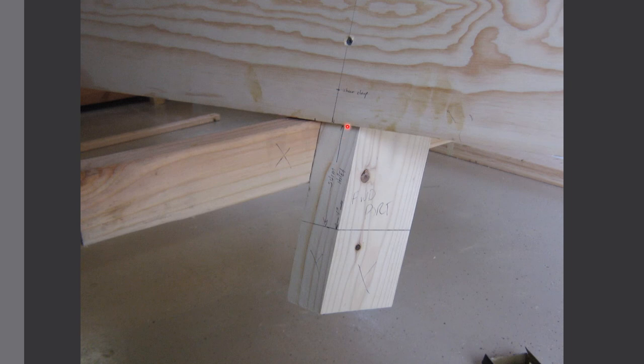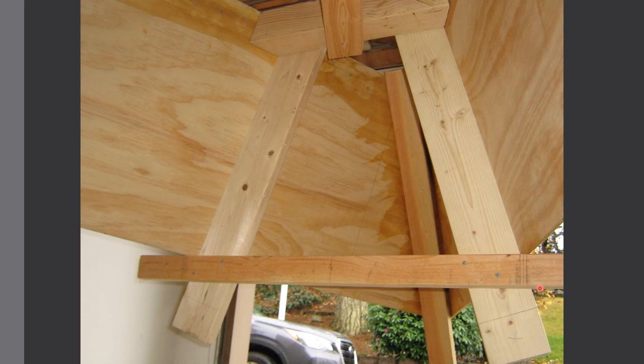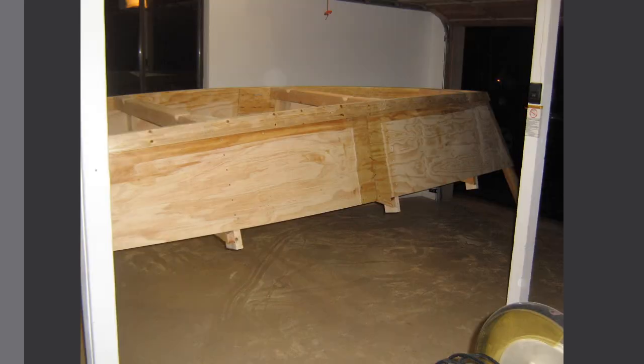Along the sides, I marked the frames so they would extend beyond the sides four inches — so four inches down from the top edge of the side panel, drew a line across and squared it off. I cut off the vertical frames right along that mark using my circular saw freestyle, and cut the cross members off with a hand saw, flush with the outer side edge of those frames.